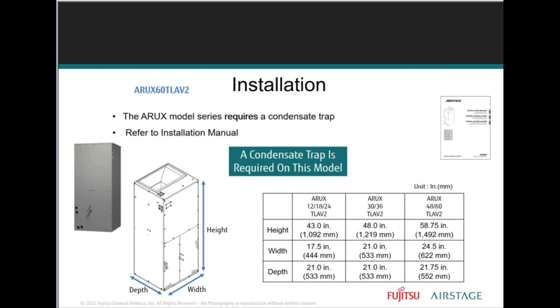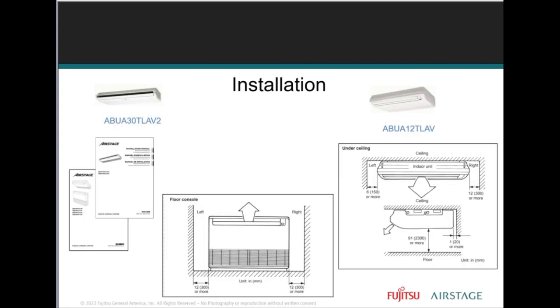And so not only do we have to do a manual J calculation, but now you have to do a manual D calculation for the ductwork. That's imperative, that's mandatory. There's no way around it. Load calculations are mandatory, or you're not doing it correctly if there's no load calculations.